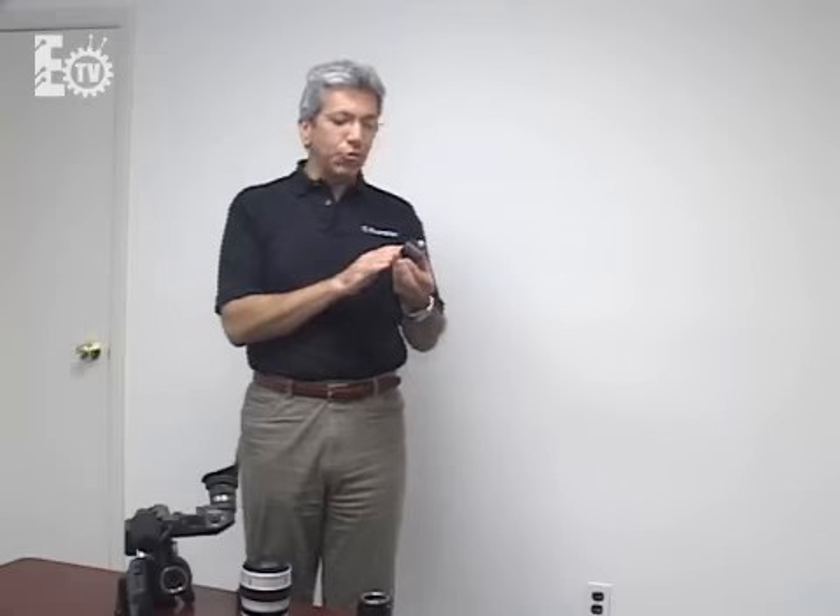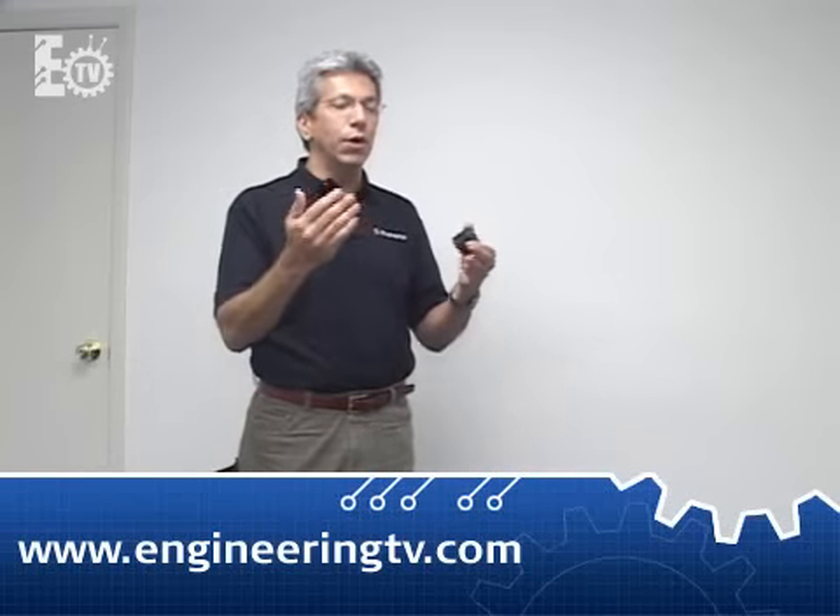That's typical for someone videotaping in a more urban setting with dark areas as well as bright light sources. One anomaly of using an image intensifier on a camera is that cameras often have automatic features like automatic gain control to handle very bright and very dark situations. The image intensifier has its own automatic gain control and a pretty constant output. Cameras also have autofocus, which can get confused by the grain in very low light situations. These things really motivate you to put the camera in manual mode, let the image intensifier do everything for you, and focus the lens manually yourself.